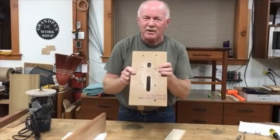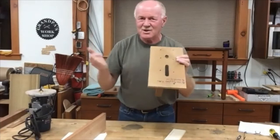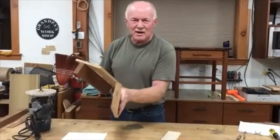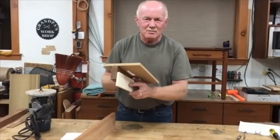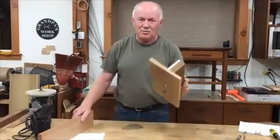And you probably could make four of these that would cover the length of the mortises in the scenario involved with, I don't know, 60-80% of the furniture you build. So it's a matter of just picking the right one for the job. And then you just need shims to adjust for the difference between the thickness of the leg and the apron. Shim stock is just whatever you have laying around. Just machine that down until it hits the center, and there you go. Excellent. So it's not expensive equipment or anything, and it's not exotic woodworking. Those are simple things to do. Okay. Cool.